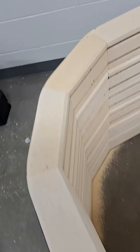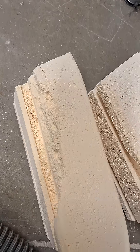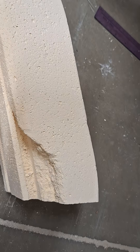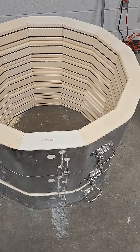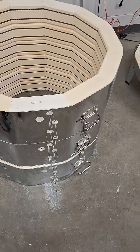I've got these new rings, and there were a couple of broken parts — broken top pieces, bricks. This is what happens when people who don't know how to move kilns and handle soft brick move things when they're unloading and unpacking, taking them out of the crates. Kiln manufacturers pack their pieces very carefully. They use expandifoam around them so they don't move or get jarred, and they put expandifoam underneath them so the bottom doesn't get all broken up.